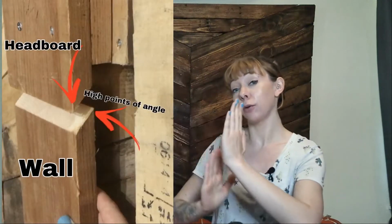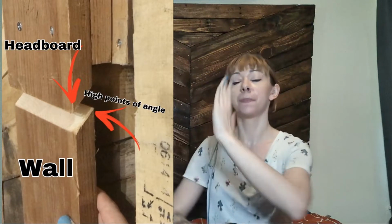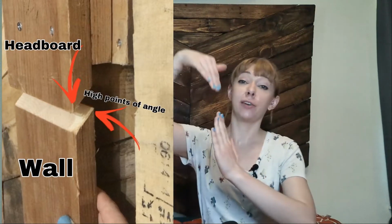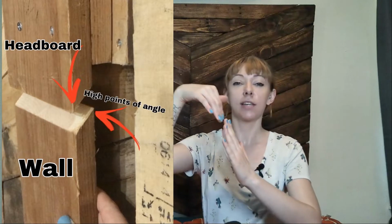So they're either at a 30 or a 45 degree angle, and they are used for hanging cabinets and heavy things. And basically you can do this with a 2x4 or some other kind of sturdy wood. You just need it to not be shitty like particle board. And you get a board, we'll say a 2x4, and you cut it at a 45 degree angle. And you put one piece on your wall. And the 45 degree angle point is going to be closer to you, facing up. And the other piece is going to be on the thing you want to hang, and it's going to be facing down. And the 45 degree angle point at its highest point is going to be, again, closer to you. But it's upside down. And then these points, they go kink when you put them together, when you go to hang your thing.